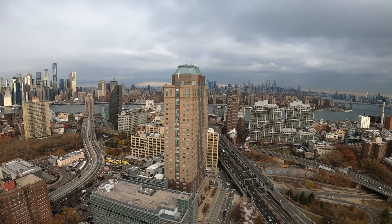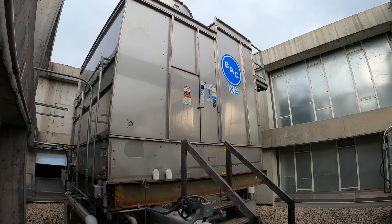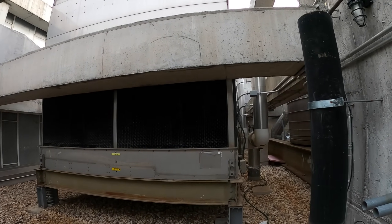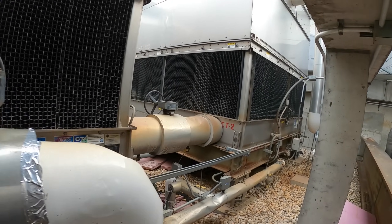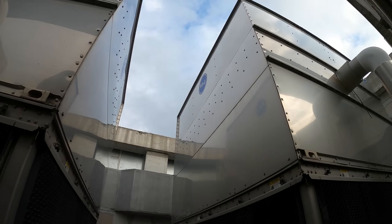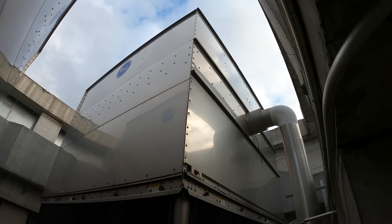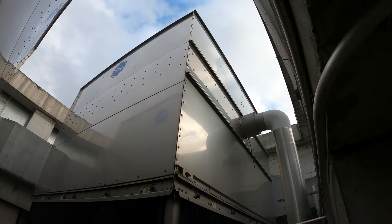This building is only a few years old and it has a share of problems, but you really can't beat that view. Right down there, that's my truck. The pumps that we see are pushing water through this cooling tower here. If we walk across this roof, we've got some crazy big HVAC units. We actually have a second tower here and it's two cells — they're connected together. These are two cooling towers and that's what those gauges are for — those large pumps. So we're pushing condenser water through it, pumping condenser water through the condenser to cool it off — using the movement of water instead of the movement of air.